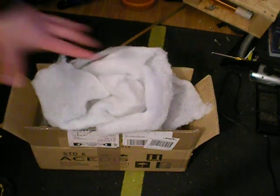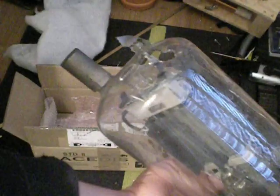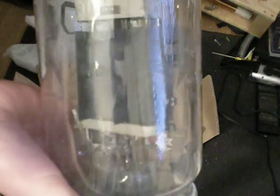And this is what happened. It broke, and it broke big time. I knew it was broken. I knew that this happened right here — the tube had gassed and this thing broke off. I could have fixed that by using a vacuum pump and re-gettering the tube if it had a getter, or I could just use an external getter. But it would be possible to fix the tube.